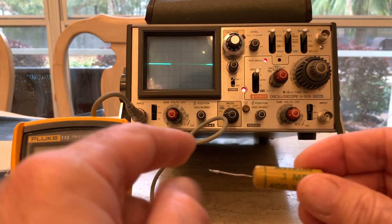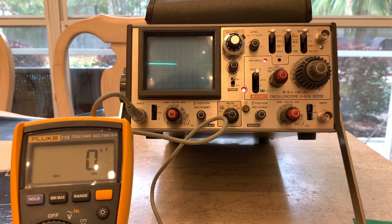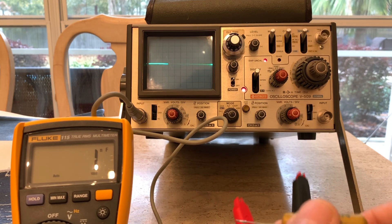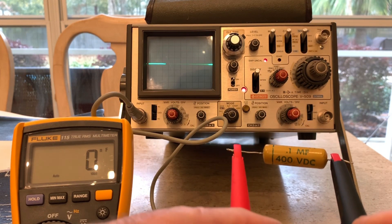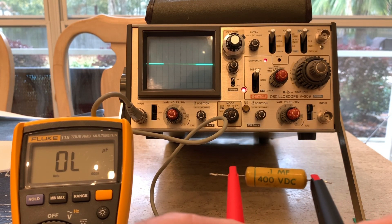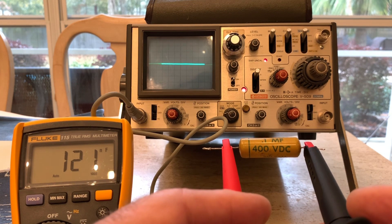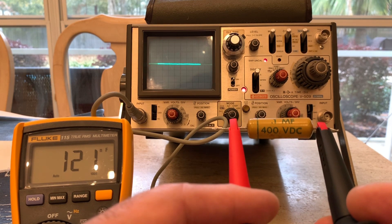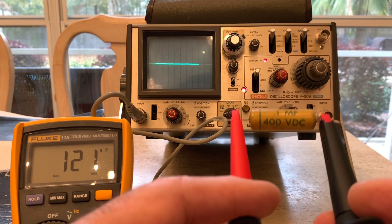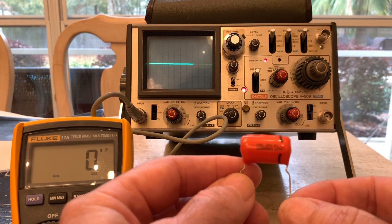I took out this old Astron and I'm going to check the capacitance with my capacitance meter. This one had drifted more than usual — the others weren't too bad, but this one is at its limit, 21% off. It should be 100 nanofarads and it's measuring 121, so that one is out of the amp.